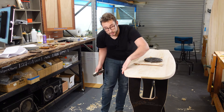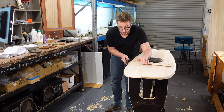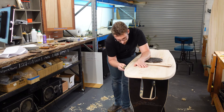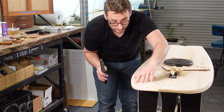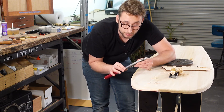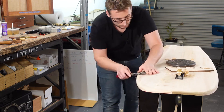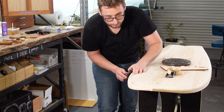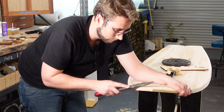So here I know I have to do a little bit more stock removal and then we can move on to using the rasp. Now that we've used the block plane I'm going to use a rasp to come in and finish it up. The same principle applies — long even strokes — but what I do with the rasp instead of keeping it at a fixed angle is to sweep it on an arc, further shaping that rail.